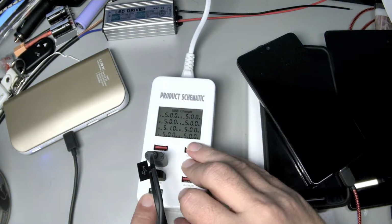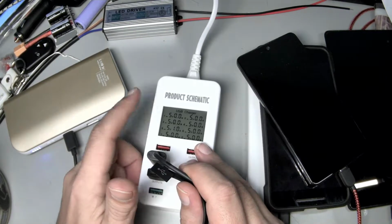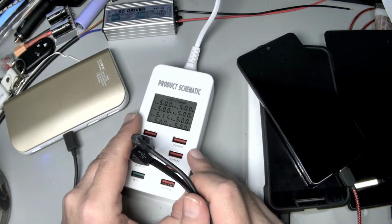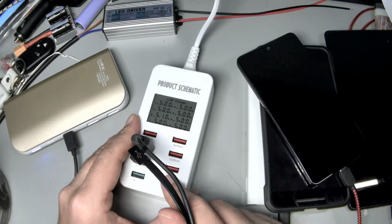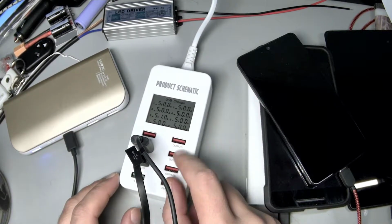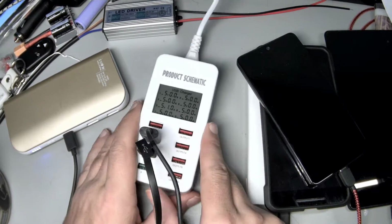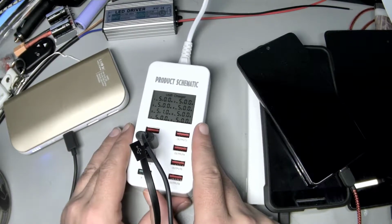But if you're using the Qualcomm port, you can easily overpower the power system, and this thing will just start rebooting. It might have been more thoughtful if they had made it use less power, or limit one or the other, right? Limit the USB bus or the Qualcomm bus, since it's like 2 separate feeds, so that the power system doesn't fall apart. But they didn't, so whatever.